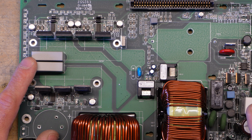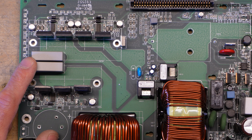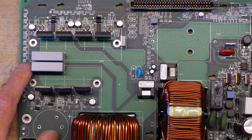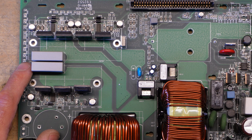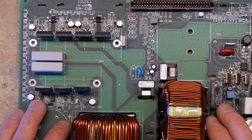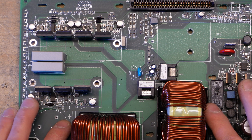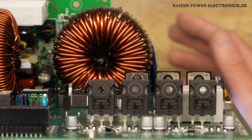The overall build quality is very high. It is a 19-inch rack unit meant for server rooms. We have some very high quality components — these are current transformers. Overall the build quality, the 105-degree capacitors throughout the board, and a lot of writing by the people who assembled this all show that everything is double checked. There was clearly some real effort put into building this unit.